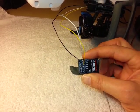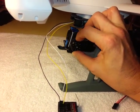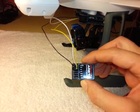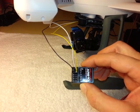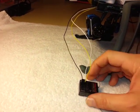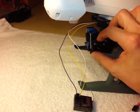And the only important connection here is that you want, or at least in my opinion I want, the independent pitch control hooked up to the throttle output, specifically because the one control on the radio that isn't spring loaded and suitable for this type of adjustment is the throttle. The yellow wire you see here is the input to the gimbal control board for independent roll control.